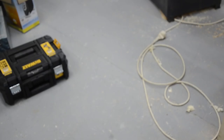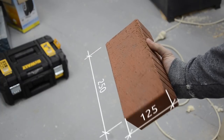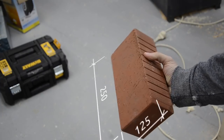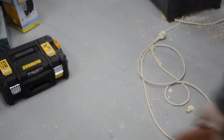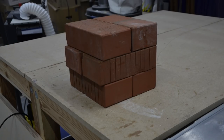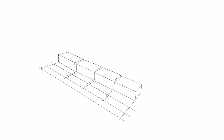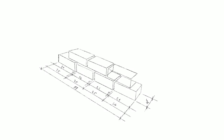This system is used in particular for bricks. So why 12.5 centimeters? Because such a stone still fits well in one hand and is easy to carry. A brick is therefore 12.5 centimeters wide and twice as long, 25 centimeters. That's why you can stack them so well. At least, almost. Actually, such a stone has only 24 centimeters length and 11.5 centimeters width. 1 centimeter is missing on purpose, because brickwork doesn't only consist of bricks, but also joints. They are 1 centimeter wide, and thus one comes again to the eighth of a meter.